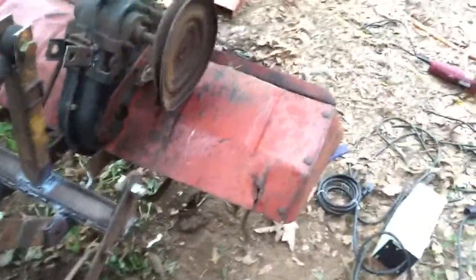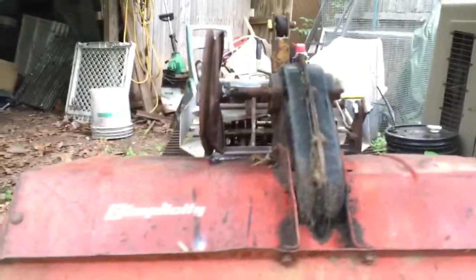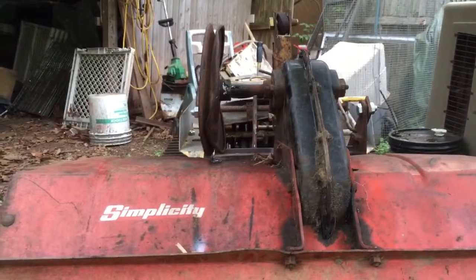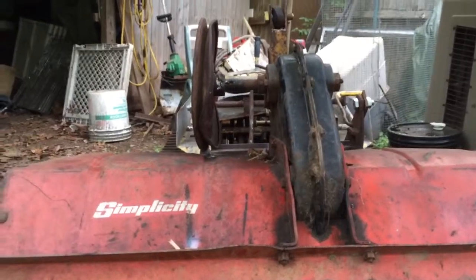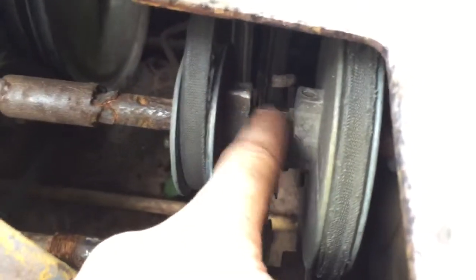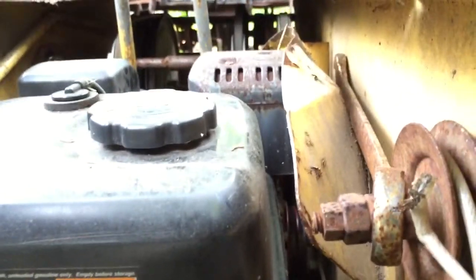So next project to go with this is powering it, which if I stand behind it, I don't know how well you can see, I can't zoom in, but dead center, well, the pulley's offset a little bit, but you can kind of see the pulleys inside the bulldozer. I can line it up perfectly to run off of that jack shaft. And as you can tell, there's a little room right here, which I could flop this pulley so the keyway, or the set screws, are on this side, and then I could put a pulley in here to run all the way back to the rototiller.